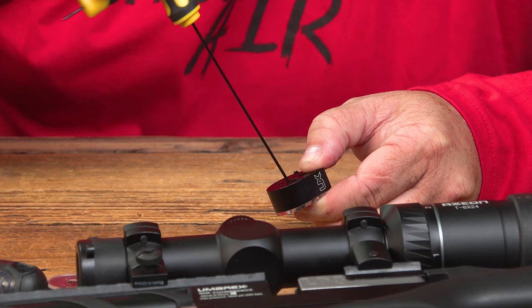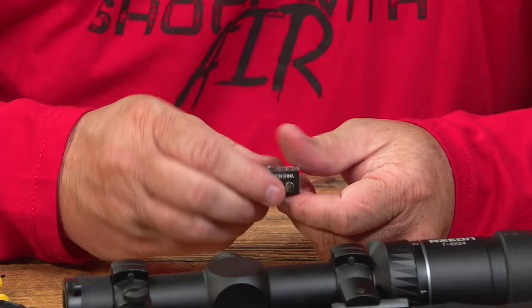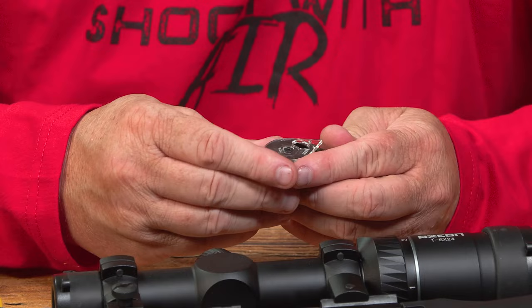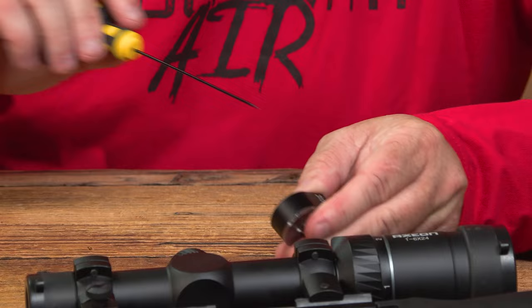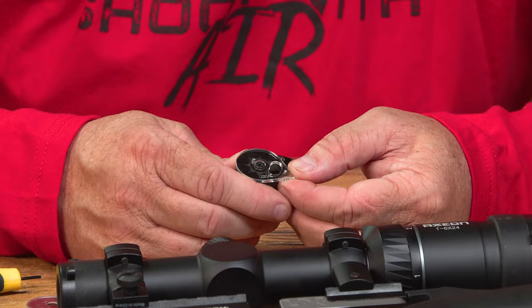It should have just a tad bit of tension on there. So when you're operating this, a little bit of tension. Now that I've found the tension on there, I go to the back. Again, you can take this Allen set screw out of there and put some blue Loctite on it. Now that I have that, I'm going to tighten this down so that it holds tight here. You can back it off all you want — we're talking like an eighth of a turn, maybe, if even that. Just enough to pull tension. If you have just a little bit of that spring right there, that seems to work the best. Then go back to the back and tighten up that tension screw. The Loctite makes it nice. If it doesn't fully snap back right away, after a little bit of use it'll start working its way through.